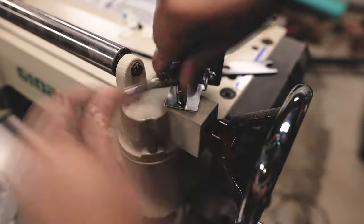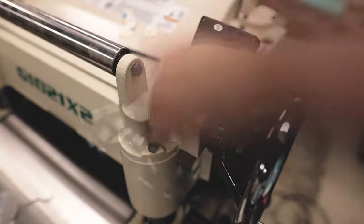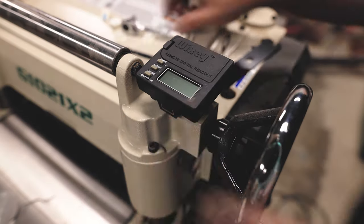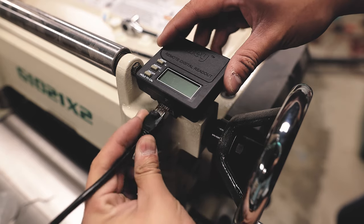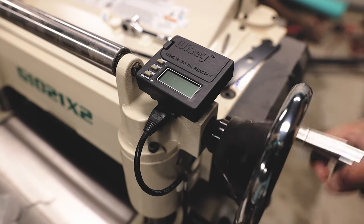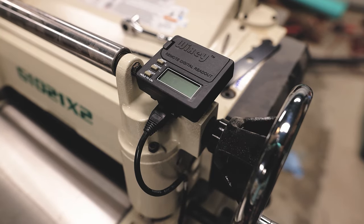To install the readout, you're going to use the smaller drill bit and then screw in the M4 x 8mm screws. There are also two nuts on the side that allow you to tighten the actual reader if it's too loose. Then connect the Cat5 cable, stick on the cable management clips, and route the cables underneath the bed of the planer so they stay out of the way.